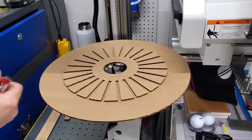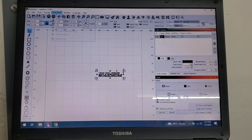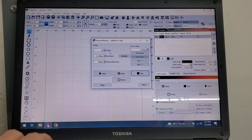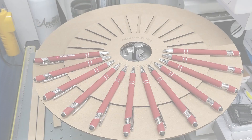So this is the jig we've made on our CO2 laser for the pens. This is after loading the 12 that we're going to do on this particular job. Now we're in LightBurn. We're going to use the repeat marking option. We've already got it set up for 24 to calculate our angle — there's 24 total. Then we reset it to the number we're going to burn, which is 12. Test our placement and start the job.